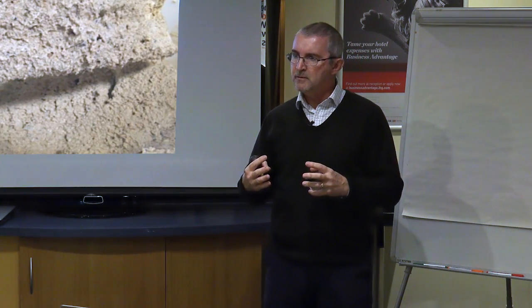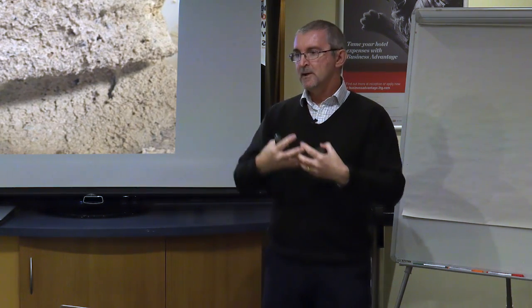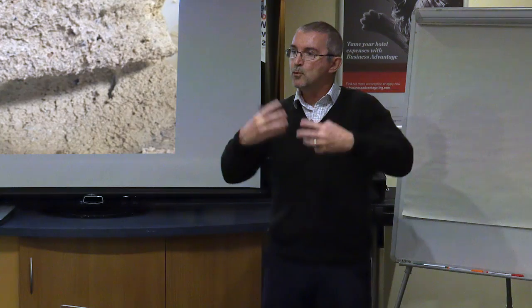and when it's built into historic buildings, one of the beauties about old buildings that are historic, built with soft limes, is that they can bend. Modern buildings, if you get a structural movement or a sudden sort of ground movement or something, they will crack, because they're very, very strong and robust and essentially brittle. Whereas historic bricks and historic mortars are very soft.